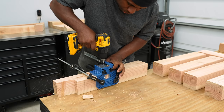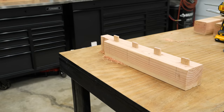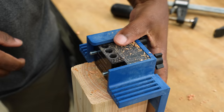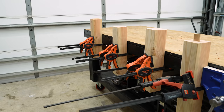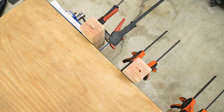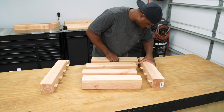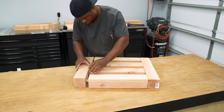I have a limited amount of tenons on hand so I'll drill the 3/8 inch first, then switch to the half-inch ones once I get low. Now that I have the sides drilled I'll focus on the end grain. With so much to drill I set them all up so I can move from one to the next quickly — once you have your reference line in place this goes by fairly quick.